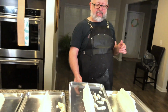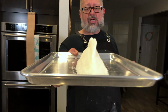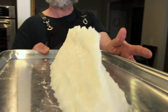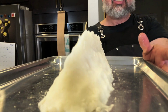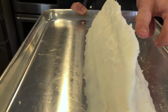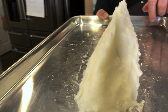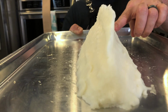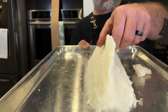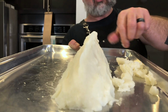Okay? So now let's go to this other type. It doesn't look much different to you, but you might notice that the base is fatter. This is a very hard knife, okay? So these are a little bit more high-end, some of your super steels with a high hardness rating. You're going to see that the apex is below it, but on the bevel down here, we've got a burr that's standing up like a wire edge, but it's thick at the base and it's shorter, okay? But because this metal has good edge retention, it's more brittle, and so it's going to be much easier to break this off. And once we break it off, once again, we can see that the apex was below it.